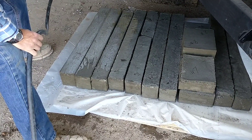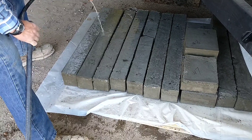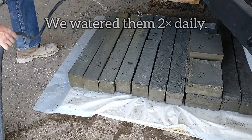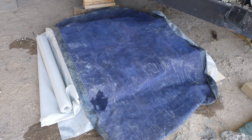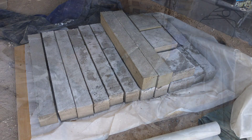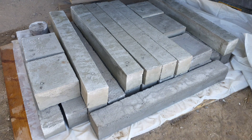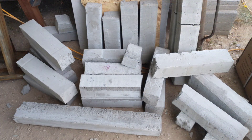A note on testing: we decided to allow these samples to cure for seven days and then test on the eighth day. We chose this somewhat arbitrarily because we're just comparing these samples to one another against our standard mix baseline. It's not important that the aircrete is at 100% strength — if it's only at 80% after seven days that's fine. We're comparing them all to each other consistently, though they would continue to strengthen if allowed to cure the full 30 days.